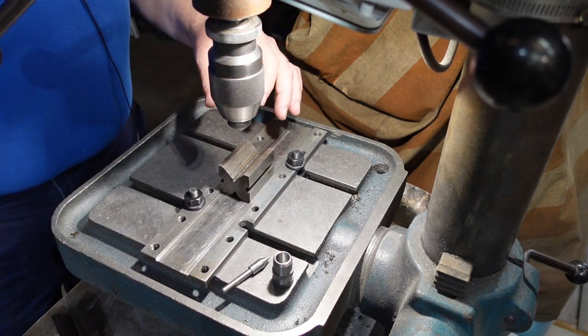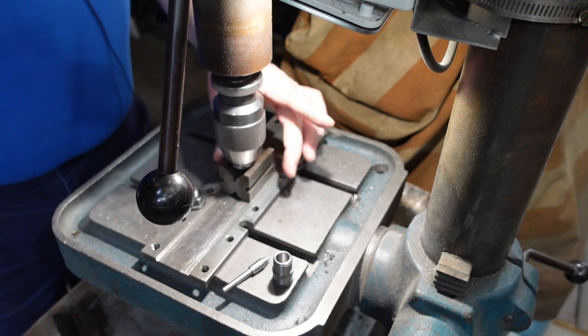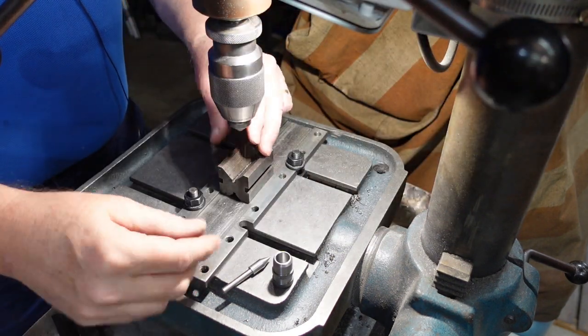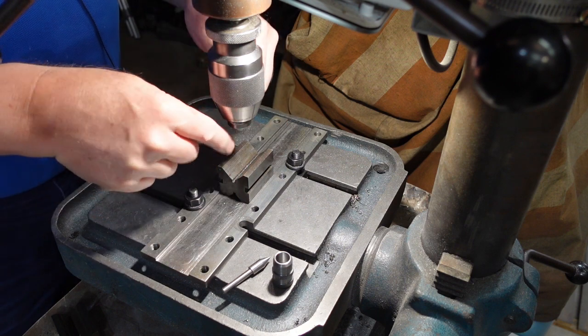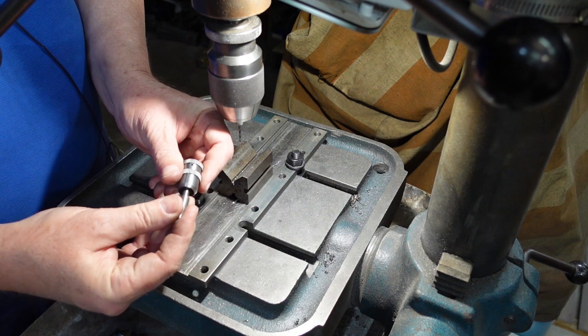In the chuck I've got a 90-degree cone that matches the V-block. I can put that in there and bring it down with the T-nuts loosened off, centralize the cone in the V-block, then tighten those up. Basically the axis of that V should intersect the axis of the spindle to secure the plunger to the handle.